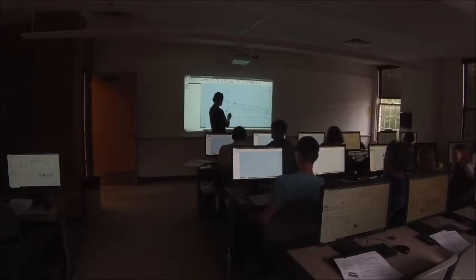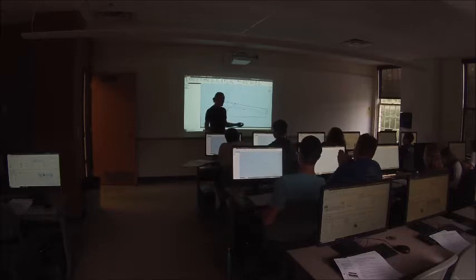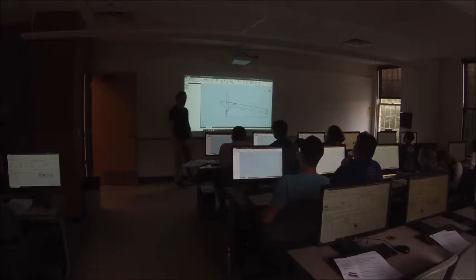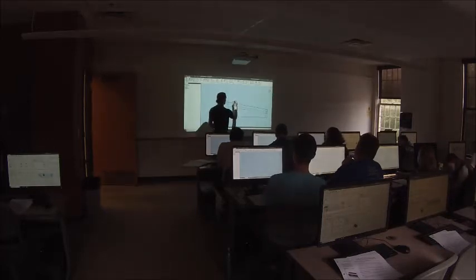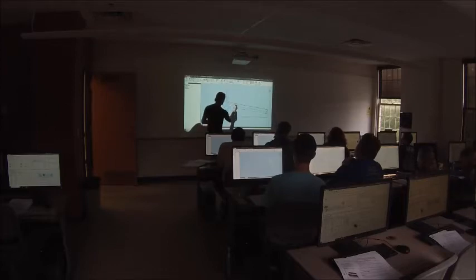Moving on. Okay, so we just need to attach this center point to the tube somehow, right? So the easiest way to do that is to just go like that. Yeah, I like the first one better. Well, we're not doing the first one. Now in reality, there's going to be some side load on this bracket, right? As it extends, there's going to be some side load. So I prefer to make the bracket look more like this, right? And then we're going to rivet it to the side of the tube. So it's going to have to overlap the tube like this, and then we'll have holes that go down, right?